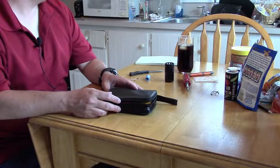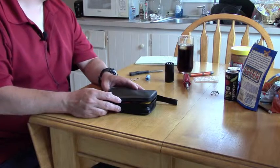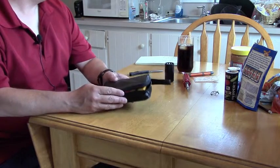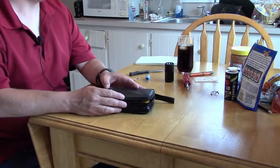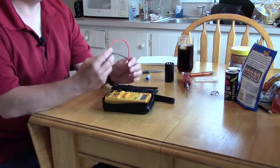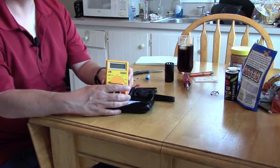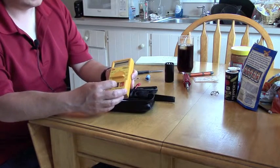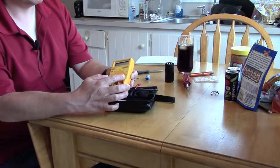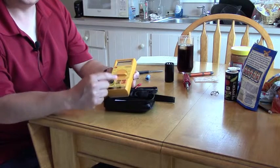What I ended up with was one I found on Amazon — it's by General Instruments, the CAP 1500. It comes in a little pouch and varies in price from $25 up to about $40. It's fairly nice; it's got a couple of small alligator clip leads that go into the meter. The meter has a range from 200 picofarads up to 20 microfarads — a pretty broad range. There's also a dial for zeroing out the display.